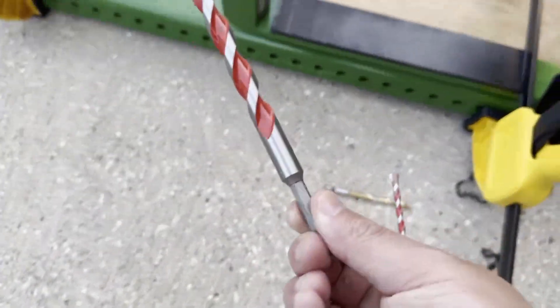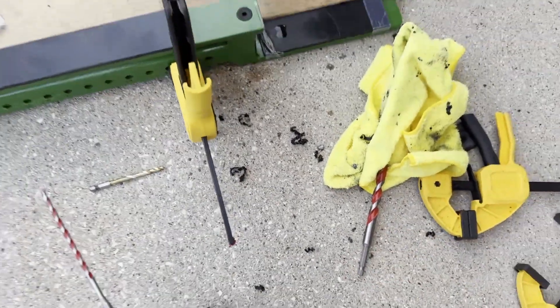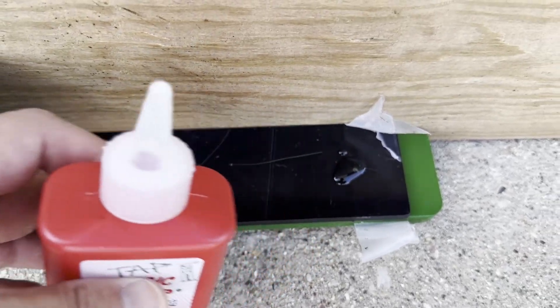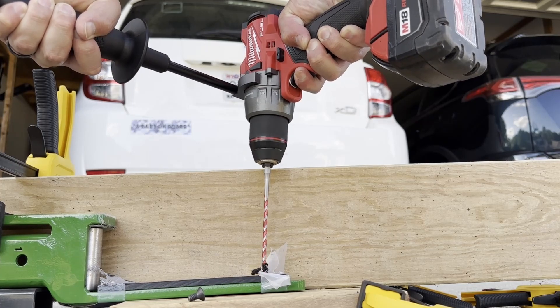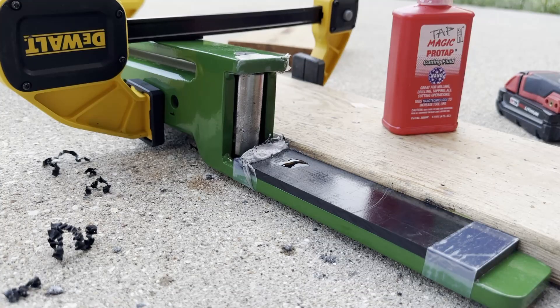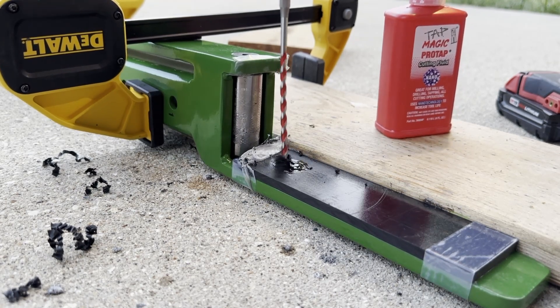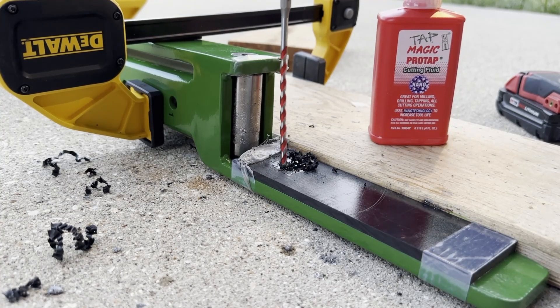I'm going to have a full description and breakdown of what I did in the description below and everything that I used for it. Alright, let's get started — make sure you have everything secured down before starting. I already knew where I wanted to put my hole, so I put a little tap fluid to just start the pilot hole, and I took my hammer drill and my carbide tip to start making the first hole. Going through the UHMW plastic it's going to go really fast; however, the most challenging part of this whole project is actually making a hole to go through the metal.